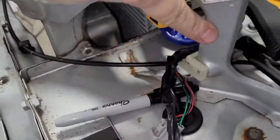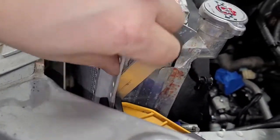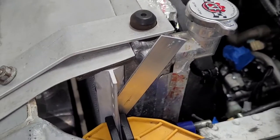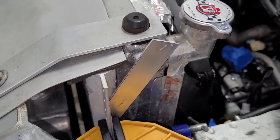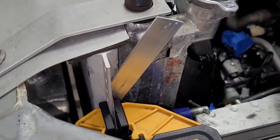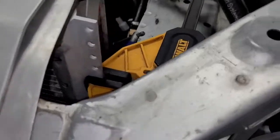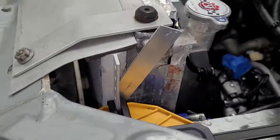So before we had it over here, and the handle of the tail was running into this piece of metal, which had moved my condenser outward like this. Actually moved it quite a bit. So in fact, it moved it so much that my bracket didn't line up anymore. And I was sitting there like, man, how did I screw this up? And then I kind of backed up and noticed that the condenser had a 1/2 inch gap between it and the radiator. So, simple mistake, simple solution, but when you're doing fab work, kind of keep an eye on things.